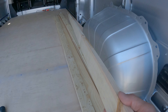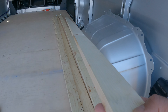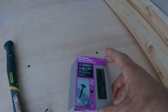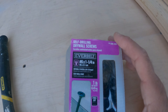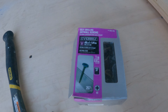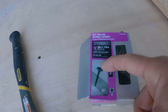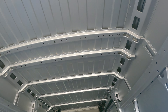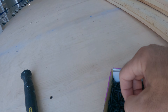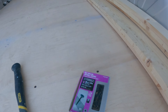This is what I'm going to use for the furring strips for the ceiling and also for the walls — it's a 1x3 pine from Home Depot. These are the screws I use, also from Home Depot: number six, inch-and-a-quarter, self-drilling. They're designed to go from drywall into metal studs, so we're going from wood into metal studs — perfect. It has a self-drilling bit on the front, and it works great for this purpose.